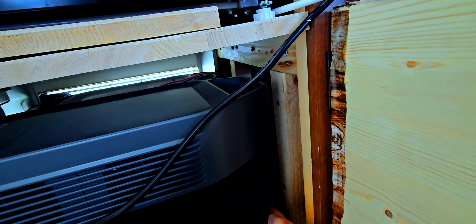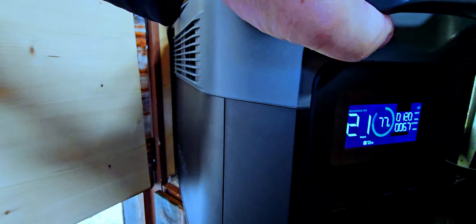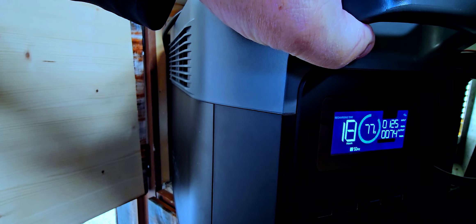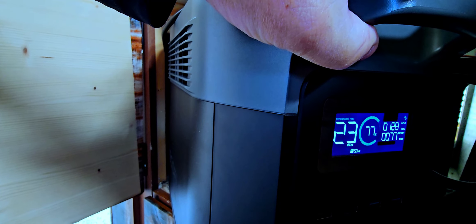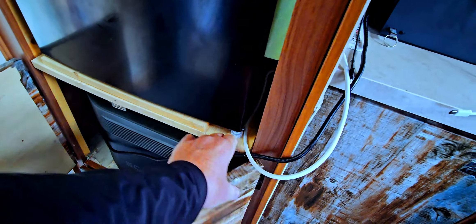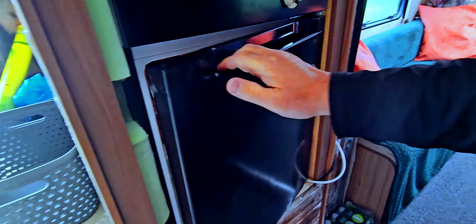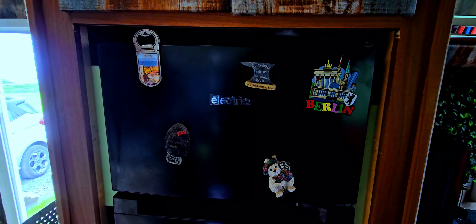At the moment the solar's working. I'll just have a look here. You can see it's using 74 watts of power but it's putting in 127, and it's climbing all the time as the sun comes on — which is great. So I'm putting in more power than I'm taking out, and that's 600 watts on the roof with only the fridge running, which is absolutely fantastic.